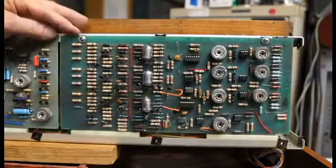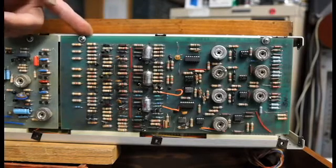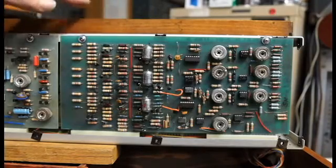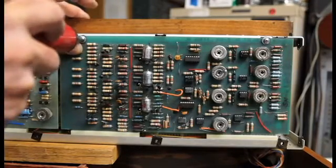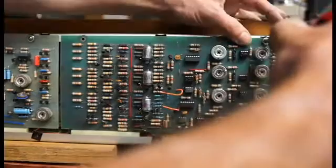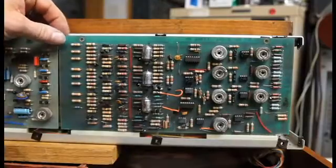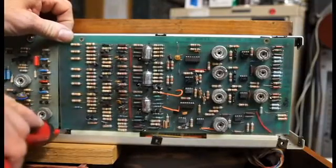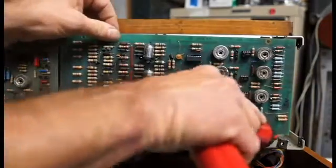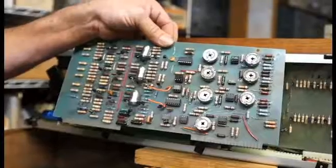The board is held in place by two screws, one on the left and one on the right, and there's a plastic or fiber washer behind the board that spaces it out from the chassis so things don't short out. We're going to take out these two screws. The two little washers will fall out but we'll just grab them. The easiest way to lift the board out is to put a little screwdriver underneath the edges and gently walk it up, and it comes right out.